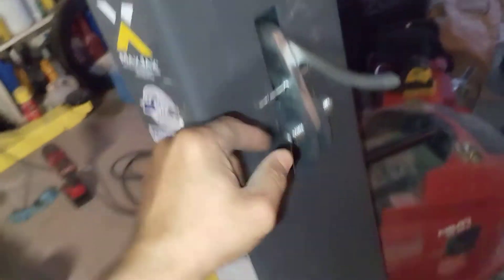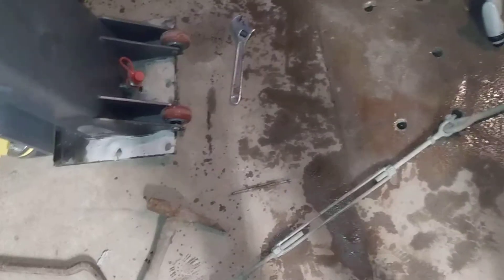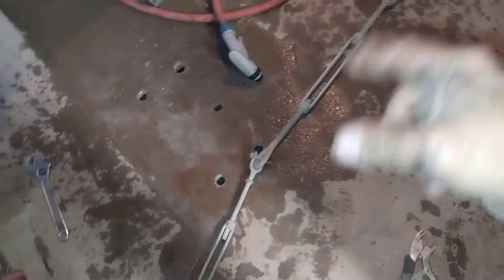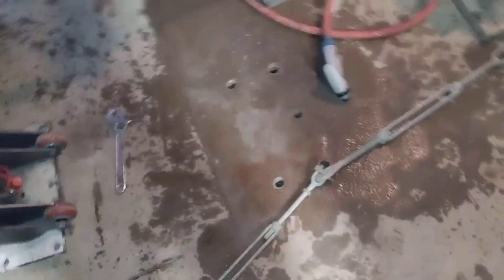I'll make sure it's not too much of a reaction and won't buckle or do anything funky. I'll observe it — if it's getting tension I'll know just by putting my hand on it to feel how much. If it is, I may consider rebolting the connection in a different style. I won't remove it, but I'll consider not creating pull there, or reinforcing it to add the extra overturning resistance.